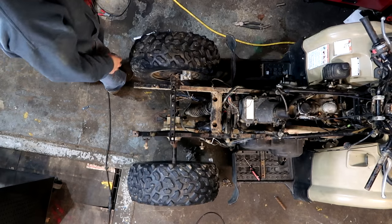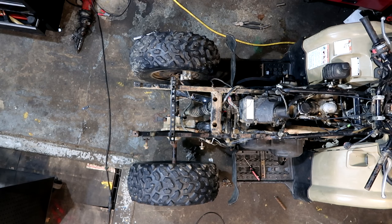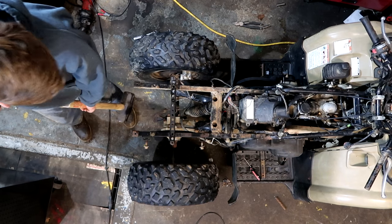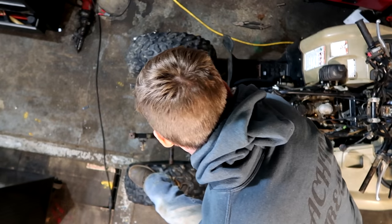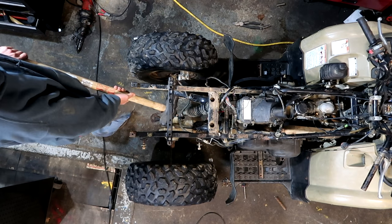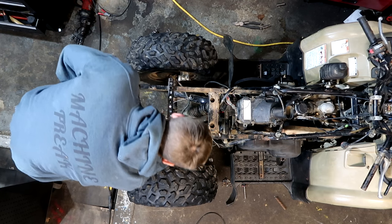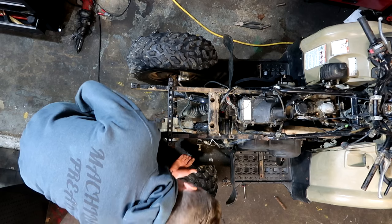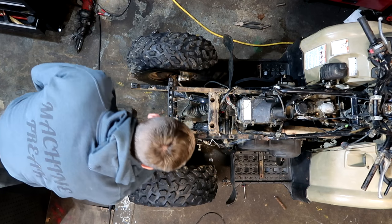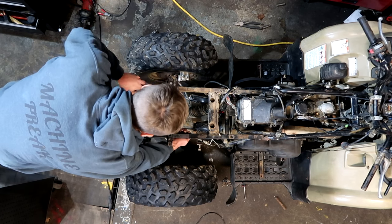Ouch. Sledgehammer — I just bought one a while back. I'm not a lefty, definitely not a lefty. I wish the left side was screwed up so I could just whale it like this. Now what I could do is cut it right here at this bend, take a piece of pipe, drag this side over, take that pipe off, put a new pipe on, slip it on this side, pull it out, and then re-weld those two. It's just going to be difficult lining both of those up once I re-bend it.